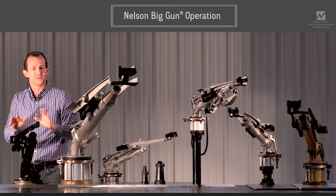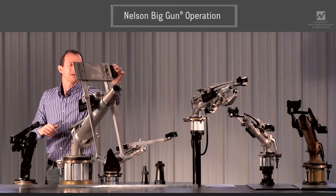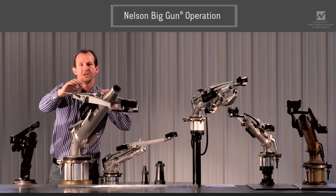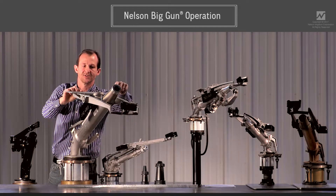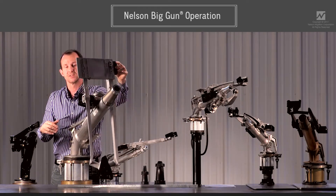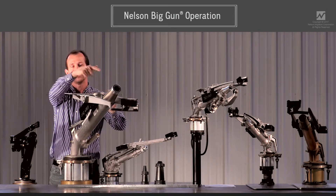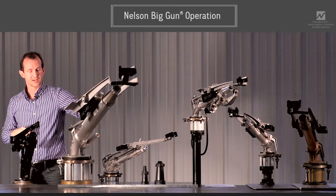In each of these sprinklers, you have a little bit of adjustment on how fast the sprinkler will operate and travel. On the slow reverse guns, we have an arm weight right here that I'm holding in my left hand — it is bolted to the drive arm, and there are several holes that allow you to move the location of that weight. If you move the weight closer to the nozzle, you have less force, it slows the sprinkler down, and generally increases your arm swing. If you move the arm weight back towards me, it will shorten the arm stroke and speed up the sprinkler's rotation in both clockwise and counterclockwise directions.